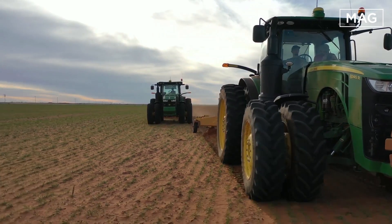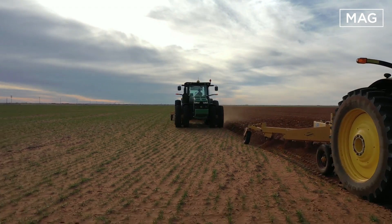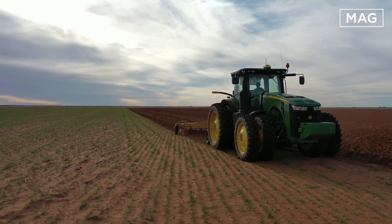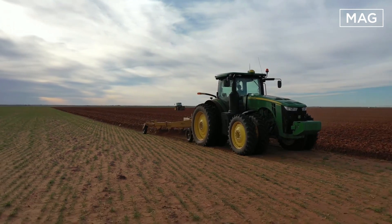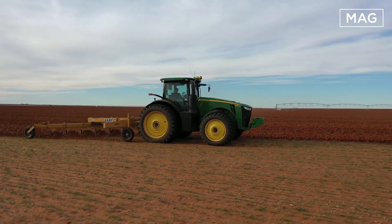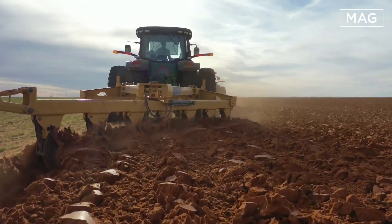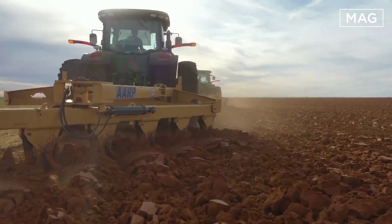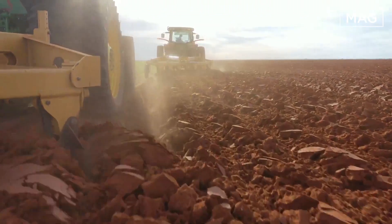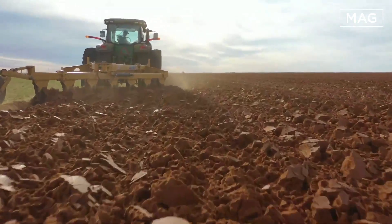You can see the moldboard plows pulled by two tractors, the John Deere 8345R and 8320R. This is the 8R series with engines ranging from 245 to 400 horsepower — a world-class heavy gear designed to provide hydraulic capacity and horsepower to handle large plantations and equipment. The two tractors differ in engine and transmission; the 8320R series has a 16-speed power shift with APS. John Deere not only creates technology itself but strives for customers to have the tools needed to solve their problems, and they have also developed precision agriculture technology to reduce input costs through better machine management and improved application accuracy.